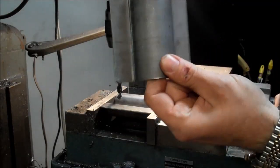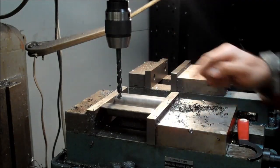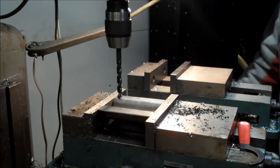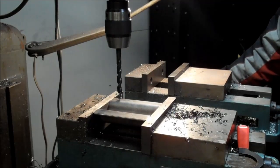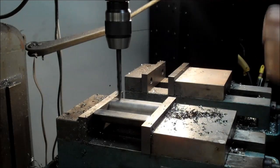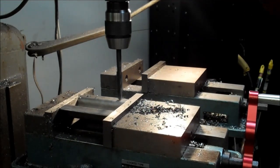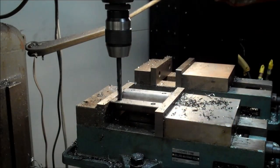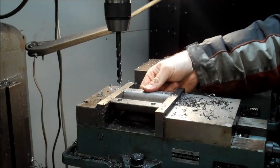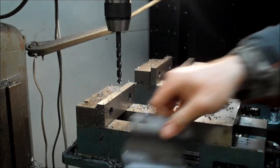We've got the first of the plates here locked into the vise of the mill. I've got digital readout — I found center where the part is, and now we're going to go in and punch in the four holes so they're equally spaced apart. That should be nice and square. You'll notice that I clamped this from the ends so that I wouldn't crush the sides down by clamping it — that'll get us nice and square holes. On to the next one.